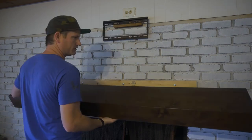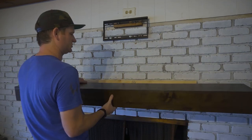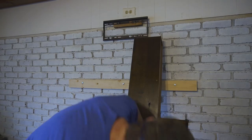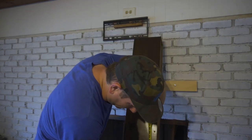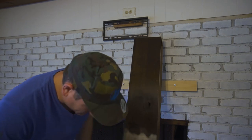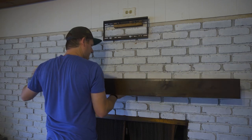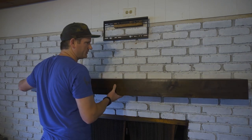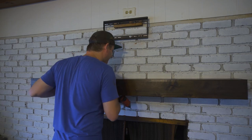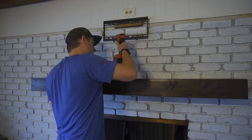There are actually four holes on the mantle to drive screws into the two-by-four to hold it on. I'm going to measure center on this mantle — it's six feet, so I make a mark right at three feet. With that pencil mark centered, we know how to line it up with the mark on the wall. The screws came with the mantle, so we'll drive them in with my impact driver. It would definitely be beneficial to have two people, but I've done it a few times before.